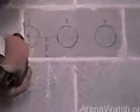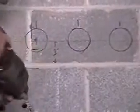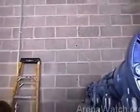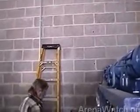You see already the installers noted where the wall penetrations and boring will be for all this refrigerant piping. We'll have a professional core driller come in and bore nice round holes with special boring equipment through the masonry. Outside sits the evaporative condenser skid and the receiver skid.